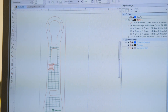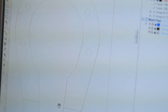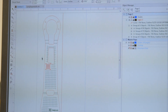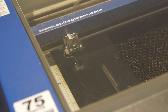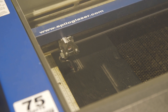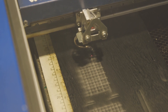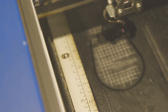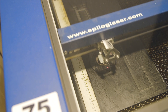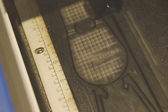What we have on the screen here is the flat pattern of the lamp that we are going to be making. The red part is the outline, so we can see we have four holes here — those are for the screws that are going to support the PCB. This is the pattern that is actually going to get cut, and the green part is what's going to be rastered. The first operation it does is raster; it's better to raster first and then cut so that way the part doesn't move. Right now the machine is cutting the acrylic. We wanted something reasonably easy to manufacture and also fast, so that a large group of people could all have the lamp cut in the same day and see the process from concept to actual product in just a day.